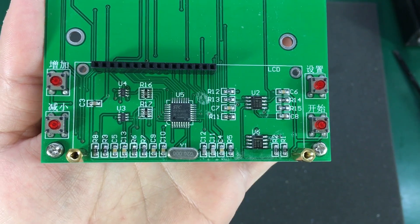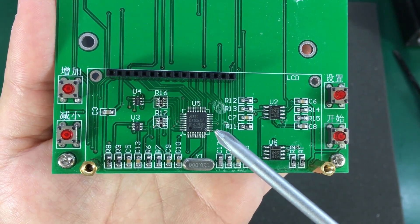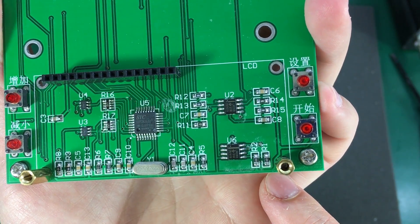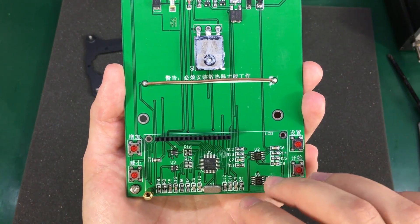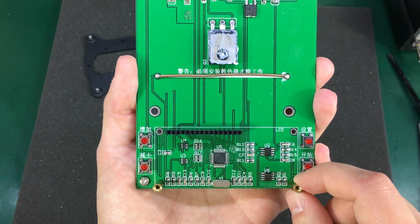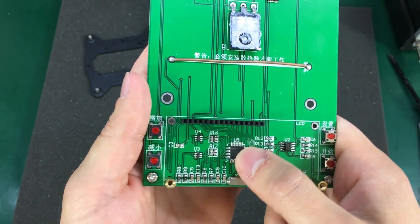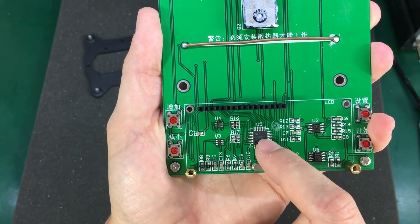On the control electronics side, I was expecting an ST microcontroller — either an STM8 or an STM32 — but they went with an STC microcontroller. Checking the datasheets, on the right side we have an LM358 dual op-amp and an LM393 dual comparator, which is the classical dummy load schematic — the same one used in my own electronic DC load build. The STC microcontroller is an 8051-architecture type, but supposedly much faster with newer technology from STC, and it has a built-in 10-bit ADC.